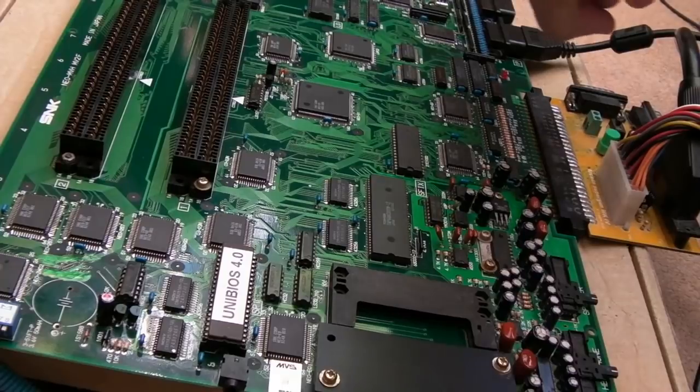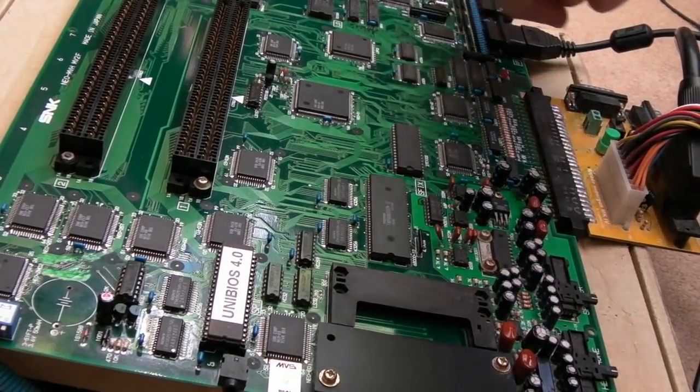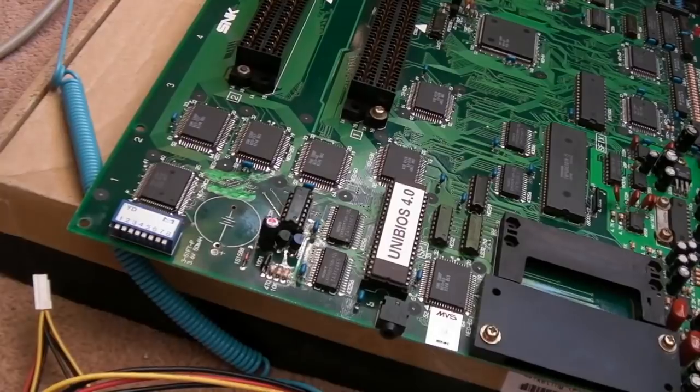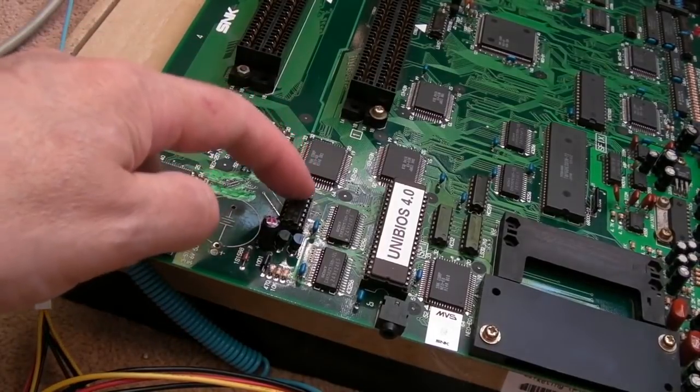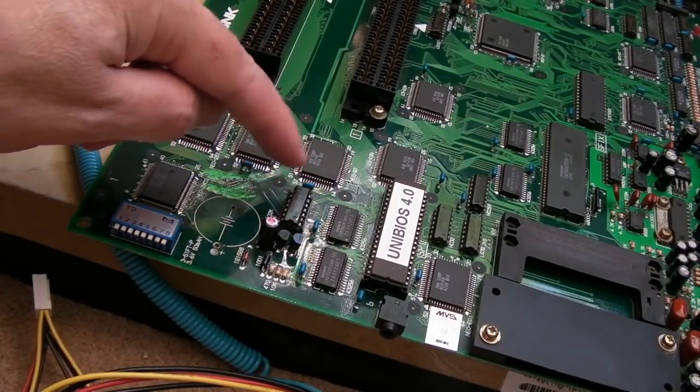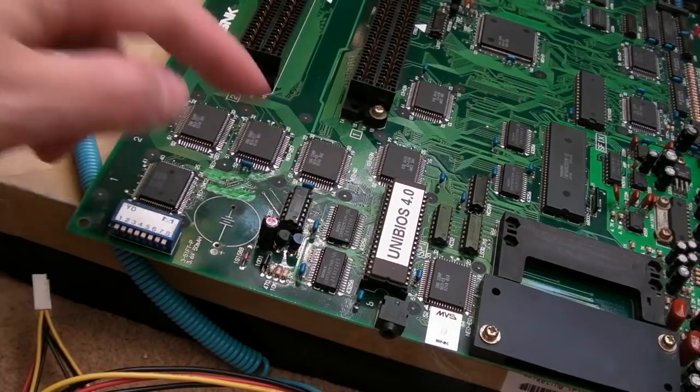There's an F0 over here, which relates to it. There's the 4990. We replaced the crystal earlier, so I'm thinking it's going to be to do with the HC32. I think it taps off from a gate here. That may be why it started working. I suspect it's going to be one of these three vias here. It could even be one of those there, I think.